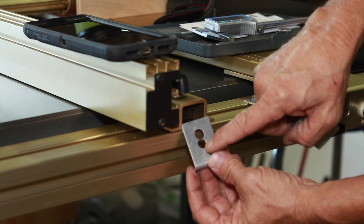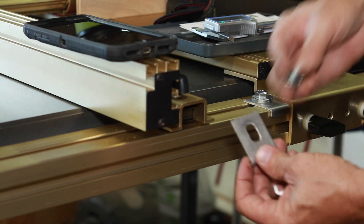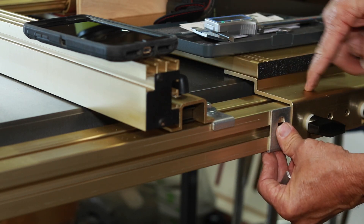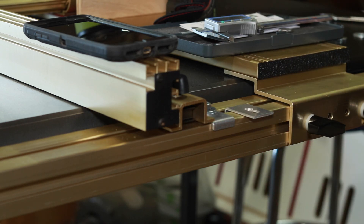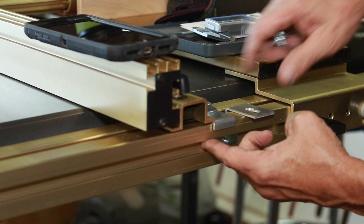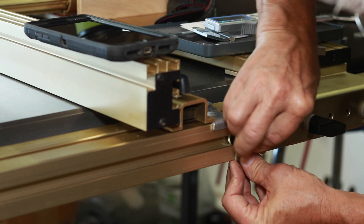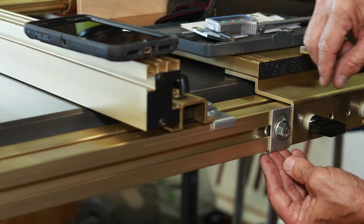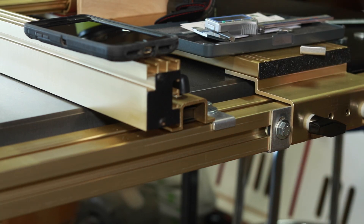This is the floating stop that I drilled with the three-eighths on the bottom, so I have to file the little peak right there out. This is what it looks like once it's done, and I've checked it so it will work. Now I've loosened this up, slid it out, I'm going to slide that one in, tighten it right there so I don't move this and don't have to readjust everything. I'm going to leave it right there, but I will have to readjust the backstop. I'll slide it from the other end through where my stops are, all the way here — there, perfect. Slide it against that, and now I've got plenty of room to push up again, so it's all square. Tighten this up now. Perfect.